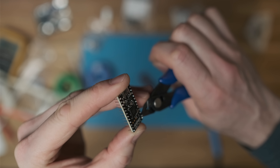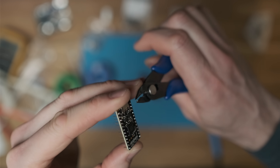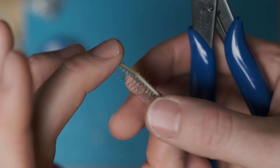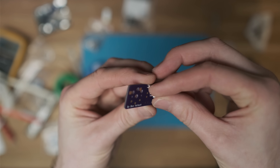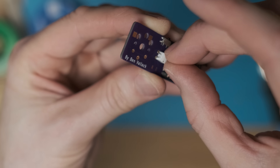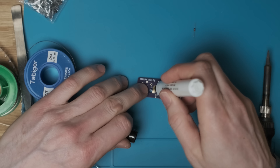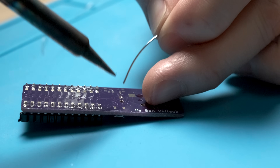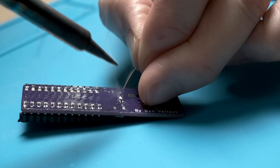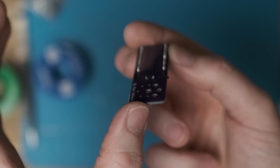We use the snips to trim off the tops where it's slightly uneven, just to neaten the top off — these very precise snips will get in and trim the end off each one. The footprint for this JST battery connector is a little bit too wide, though I actually fixed that — if you watch the video on keyboard design in Ergogen and KiCad you'll see how I fixed that footprint. It's still okay: you can just splay the legs out a little bit and they'll still fit in just fine. Then we pop some solder in there and trim the ends off with the snips again. That's our battery connector in place.